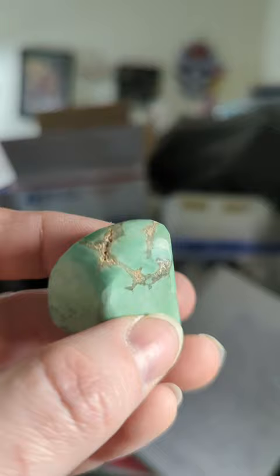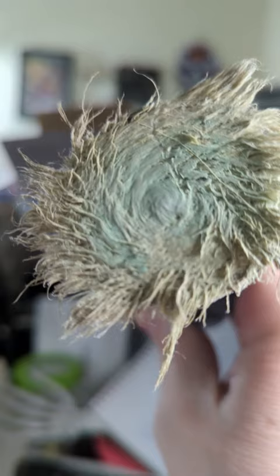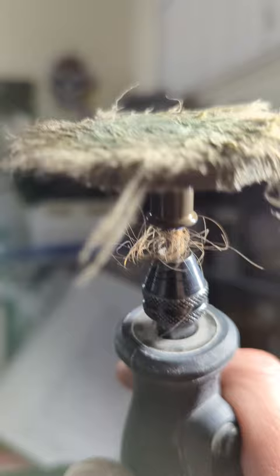The next step is ZAM. This is also on a homemade disc with muslin that has heavy-duty strings — and the green stuff in there, that is the ZAM. I'm going to use this on high power, because when you're polishing you want high power except for opals. This isn't an opal — it could be variscite, turquoise, or variscite. I don't know because my dad collected it, so let's get started.